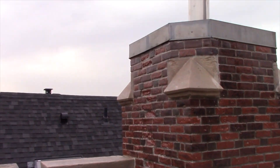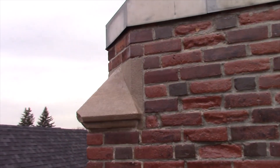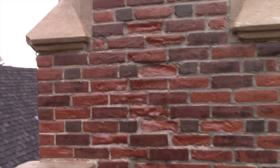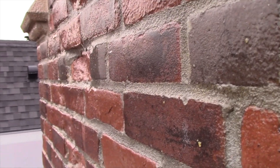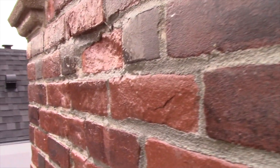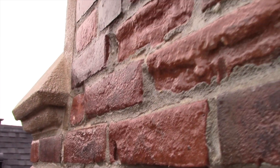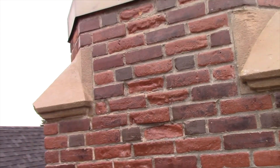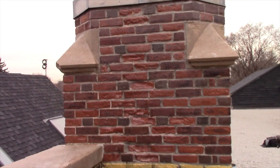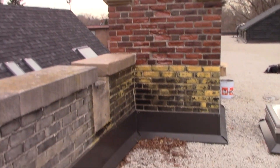These bolsters have been coated. When you get close into the bricks you can see the shine. You want the shine because it tells you — when you look into the light — if you've coated absolutely every nook and cranny. These bricks are perfectly coated, so now the wind-driven rain can hammer against these bricks and all it does is roll right down onto the roof surface.